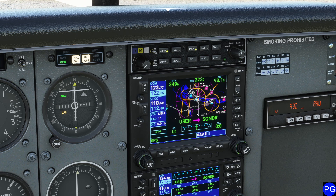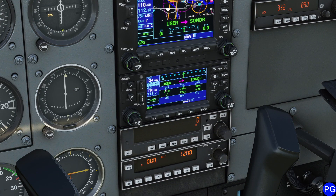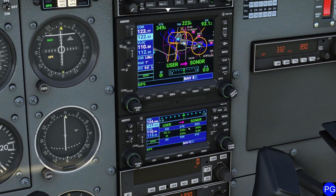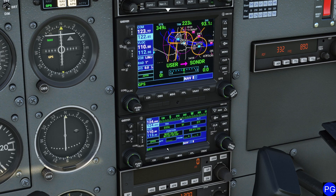You can see this is actually a wonderful unit — it's basically a G1000 with a four-inch screen. Coming down here, this is our GNS-430. It's basically the exact same thing as the upper unit. And if you look carefully, you'll notice it copied all the information from the upper unit and displayed it, which means we can see all the critical information we need here while displaying the map on the upper screen. If we wheel the small wheel over one more, we've got a copy of the two different pages side by side, with our details and a really groovy display. Page four gives you a compass, altitude, and local time — everything completely built in and working tremendously well.